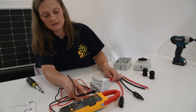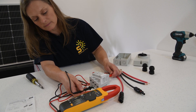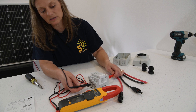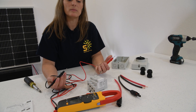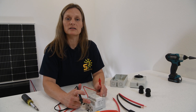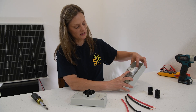We'll go to five. Five should be connected with six — it is. It's not connected with eight, not connected with four, and not connected with two. We'll check seven. Seven should be connected with eight — there it is. Not connected with six, not connected with four, and not connected with two. So that's just one way you can test and make sure which ones are connected. We've figured out that one and two are connected, and three and four are connected — and these are the ones we're going to be using to connect up our positive and negative wires.